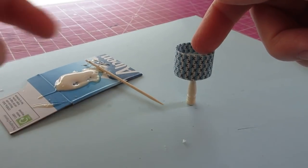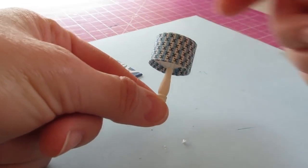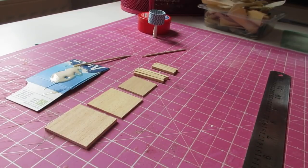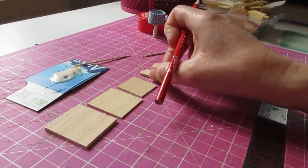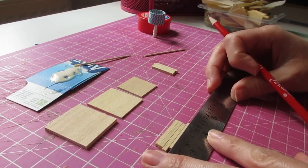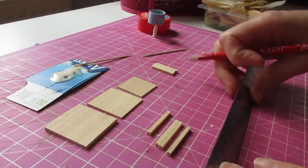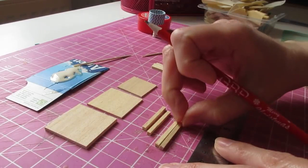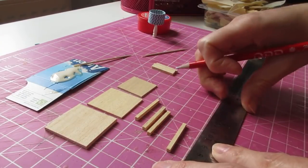Depending on the diameter at the bottom of your base you may be able to stand these up on their own, or they may topple over. If they do topple you can use a little bit of tacky wax, or glue if you want to fix it permanently. Mine doesn't stand up on its own so I'll use a little bit of tacky wax, but first I need to make a little lamp table to stand it on. I've put a cutting list for this in the description box below. We're going to begin by making a little pencil mark on each of the legs — the legs are the longer strips. We're going to do a pencil mark 3 millimetres, one eighth of an inch, from the bottom of each leg. Always make the pencil mark using the rule and not the leg you've just marked up — that way you get a more accurate pencil mark.